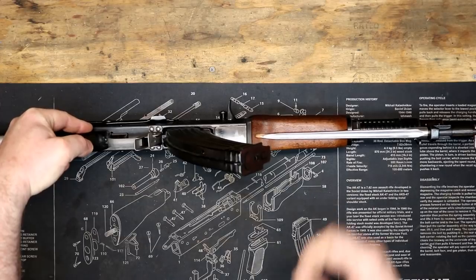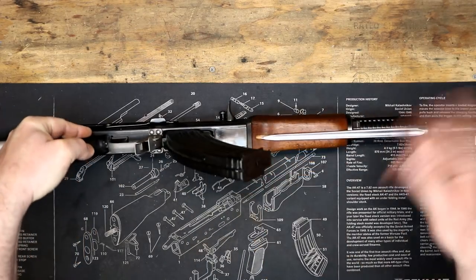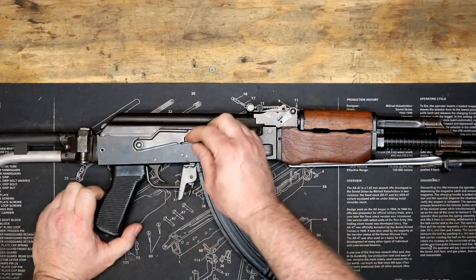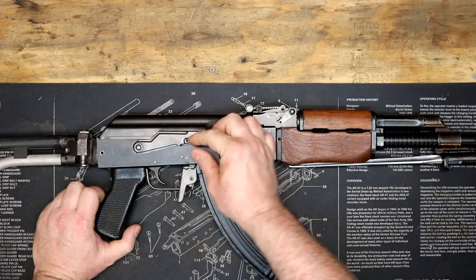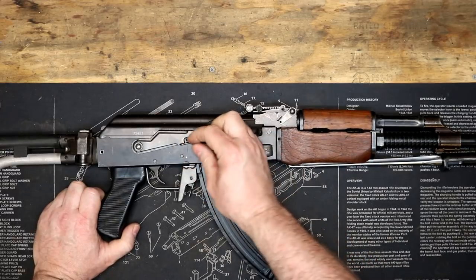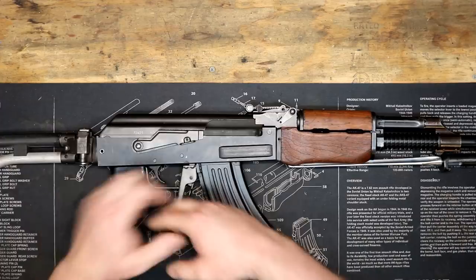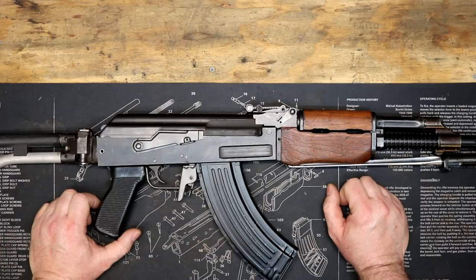I was going to sand the wood, stain it, sandblast everything, parkerize it, make it all nice and pretty, but to be honest with you, I've gotten to where I like them looking all horrible like this. There's no grooves. All it is for your selector divots here is an eighth inch ball nose end mill. I came down, picked up the little divot in the actual selector, moved it out of the way, and drilled in a little bit. That was it. There's still a slight gap here, but it's not perfectly straight in line with this. There's just a gap because it's a mismatch of parts. It doesn't have to be accurate, because what are you going to make it accurate to?